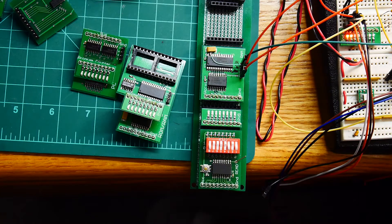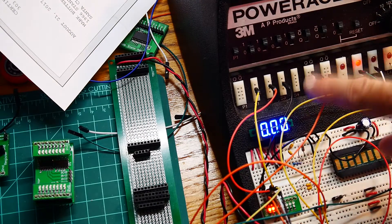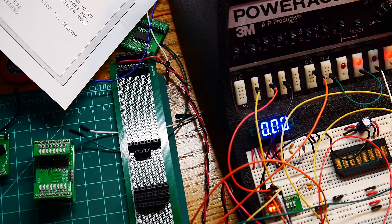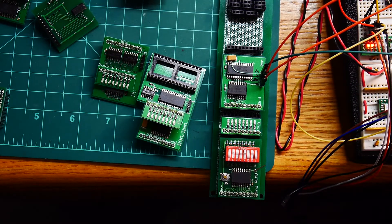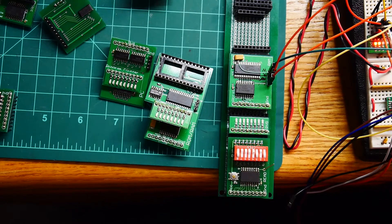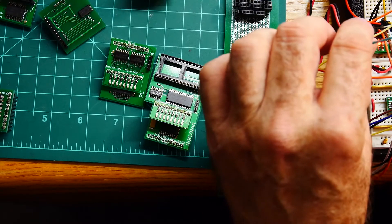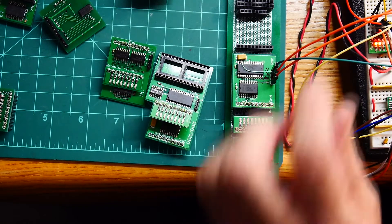I think I know what I was doing wrong. Over here I was using these switches to clock the write pulse and the read pulse, and I was going from low to high — that's incorrect. I should be going from high to low because it's active low. So I've rewired it for a low-going pulse. Let's see if we can make this work — clock the address to zero, then clock in data with the write pulse.